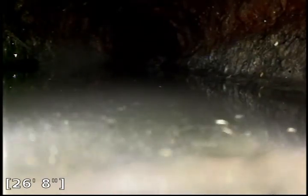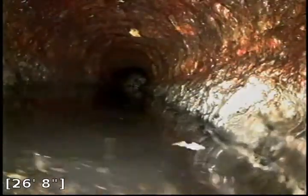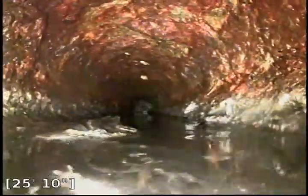You can see standing water in the line from all those deposits. You could hydrojet the line; however, with really old cast iron pipes, if you try to scrape and clean those deposits off and the pipe is extremely weak, it can actually cause it to crack or get holes from the aggressive nature of hydrojetting using high-pressure water. The line is obviously completely functional — just an older cast iron system.